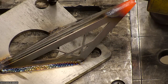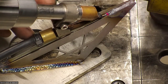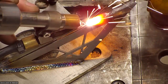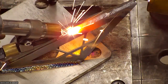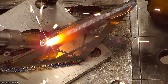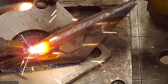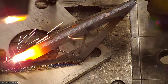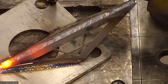I'm going to go 30% increase on the wobble — I don't need the full 50%. You might have a different technique for doing this, but I think the idea is the same: you've got to let the wire build up instead of letting it just push you flat.